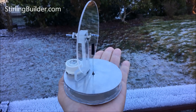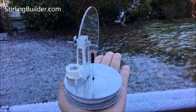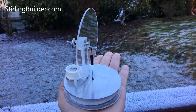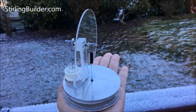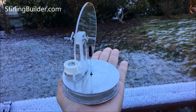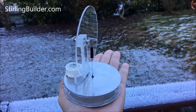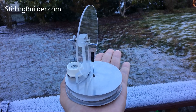This is the smaller of the two engine designs. This collection of four engines has round and square, large and small. The small ones are four inches in diameter and the large ones are six inches in diameter. And surprisingly, the smaller ones are working better for heat-of-the-hand operation. I think that's because they fit the hand — the large ones have enough extra surface area on the bottom that your hand doesn't warm it up.